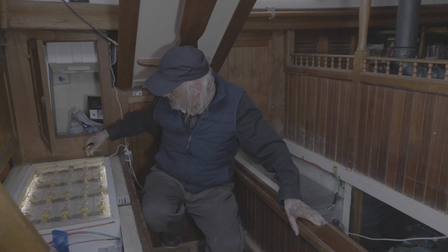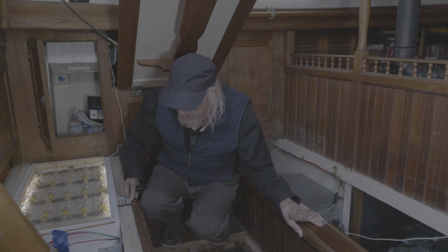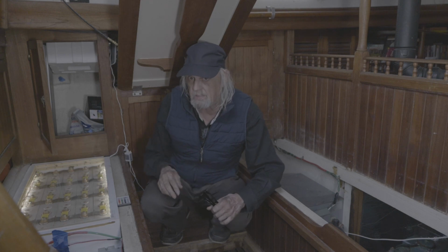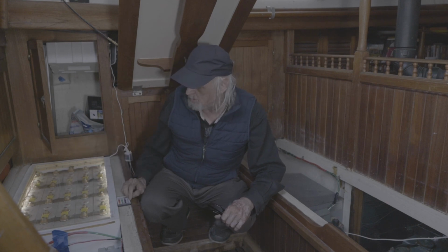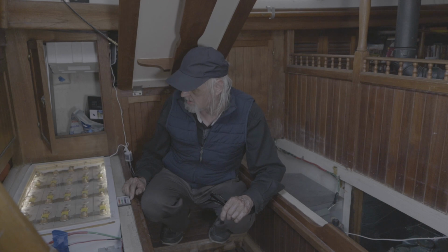what I did was I wired them together to create a 12-volt battery, because that's what this boat was originally set up for, and I didn't want to have to change everything. Plus, there's a lot of 12-volt accessories available for boats and RVs and stuff, and if you switch to 24 or 48, you're going to have problems with that. So I just decided to stay at 12 volts. I'm going to put up solar panels and wind generators. I have 2 of them on the install.